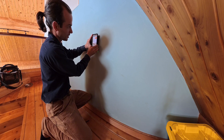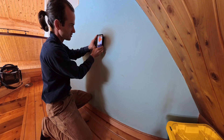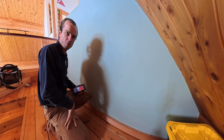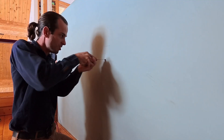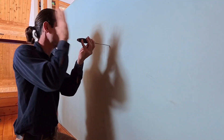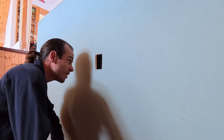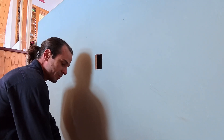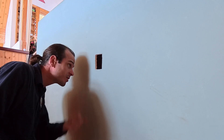I think what it's picking up is the actual box, because right here on the other side of the wall is that receptacle. If we come up and move over, that's that plastic box, and there's our stud that the box is nailed to. We can go ahead and cut a hole in the wall, look in there, see what's inside, and get our box mounted. There's our hole — ready to go, nice and clean. Looks great in there, nothing hiding. We should be able to put in our cut-in box. First we've got to fish some wire between our other receptacle and this one.